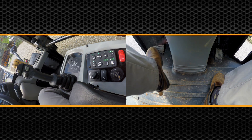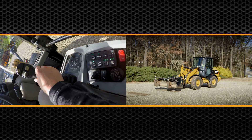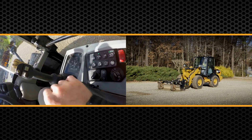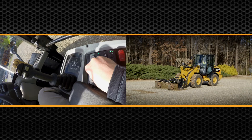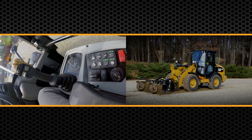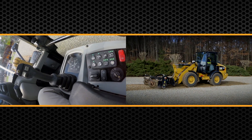When I go into forward, you're going to see I've got neither one of my feet on the pedals, and I don't have my hand on the joystick running the work tool. All I have to do, once I get my work tool in place, is drop that down, get that work tool in the ground, and activate my speed until I match exactly how fast I want to go. If I want to speed up a little bit, all I have to do is turn that dial. If I want to slow down, I can dial it back down. That allows me to not have to continually press the pedals or hold the joystick, and just focus on the work tool and steering the machine.